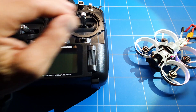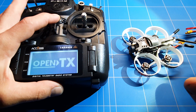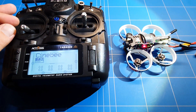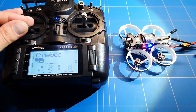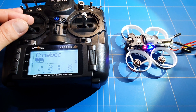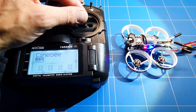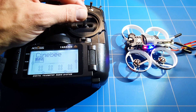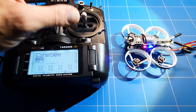Turning off the radio — actually, I just want to turn off the drone. Let's connect the drone and connect to the receiver. Now we have armed it and the motors are spinning. If we go forward, the back motors spin; backwards, the front motors spin; left, the right motors spin; and if we roll to the right, the left motors spin. So that's all correct.